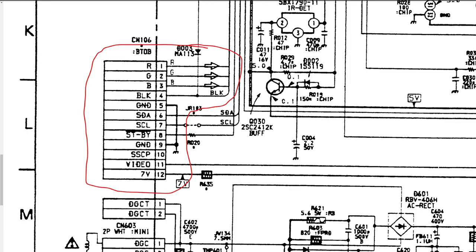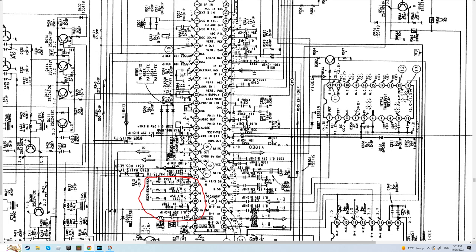So let's get into the modification itself. As I talk, I'll throw up some photos and indicators so you know exactly what I did and the resistor values I used. If we go to the service manual, it's a little bit tricky because the way it's drawn isn't exactly what happens internally on the CRT. It does show the header where you inject the signal, and it shows RGB and blanking in that particular header. But if you actually follow the schematic through, it shows you where the blanking line goes exactly.